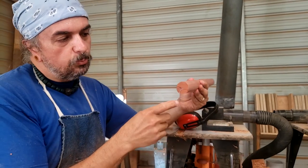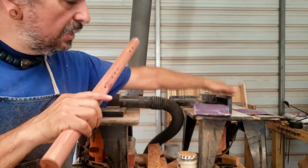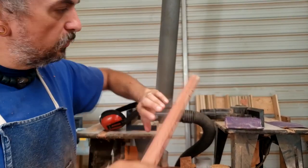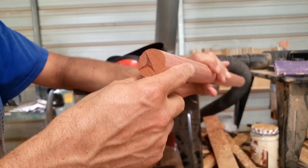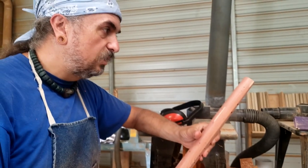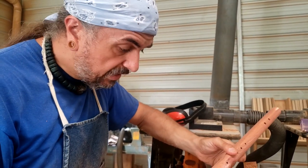As most of you can probably tell, this is quite round already as it is. It's because of the size of the roundover that I'm using there. I have a smaller roundover table right here, and that one lets me round over smaller sized flutes because the bit itself is actually quite a bit smaller. That's a one-inch roundover, and this is an inch-and-a-quarter roundover. Those various sizes will allow me to turn the square piece of wood into something much more readily turned into a round piece of wood, which is exactly which way we need to go. From here, I'll lock it in on the lathe and turn it round with sandpaper.